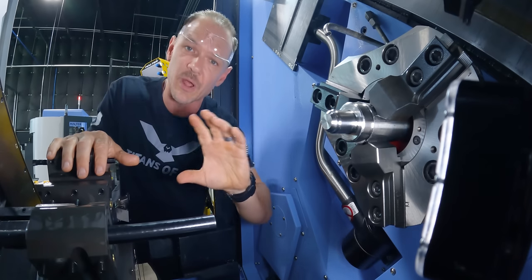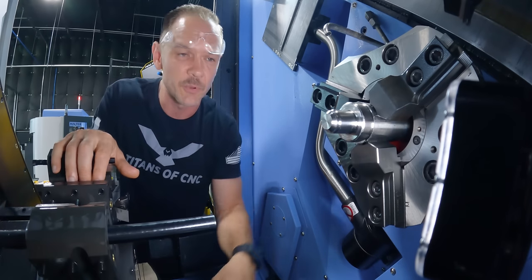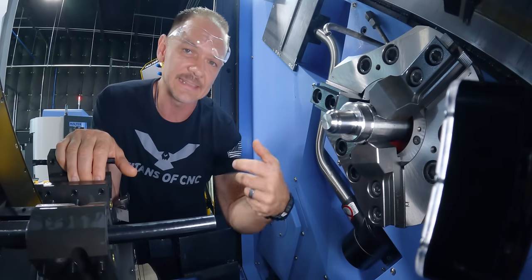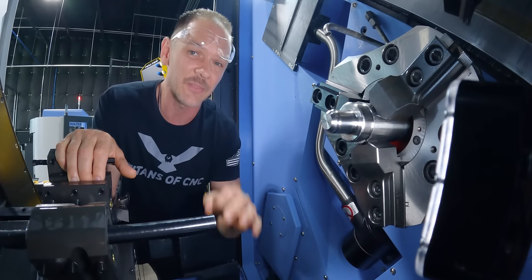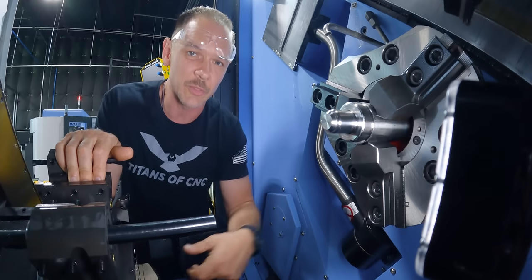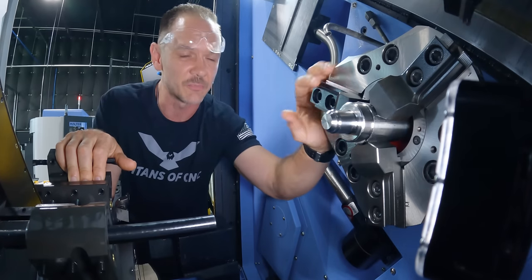This is something that you're probably gonna have to tweak a little bit based upon your current circumstance and the tools that you're using. We did use a KCS-10B from Kennametal. That insert is designed for difficult aerospace alloys, superalloys, and whatnot. So tough insert for tough materials.